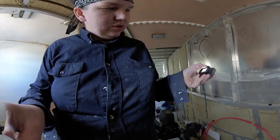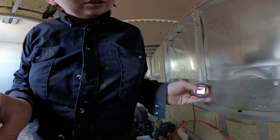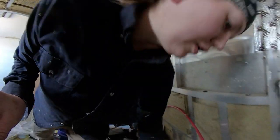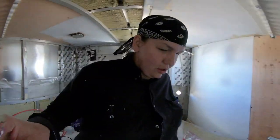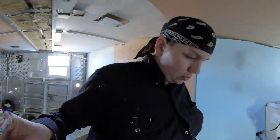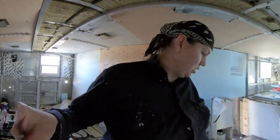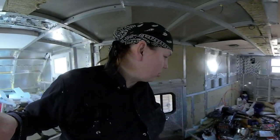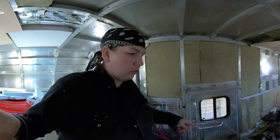We don't want that, we want this. I'm gonna make it light up with the heating icon. Then you hear the pump come on. Soon, a little bit later, we'll hear the diesel hot water heater come on and get this space thermal mass warmed up. Although I don't have any other stuff, what I need to actually do today is run my little bypass line in there so I can turn on the electronic bypass for running heat through the floor.